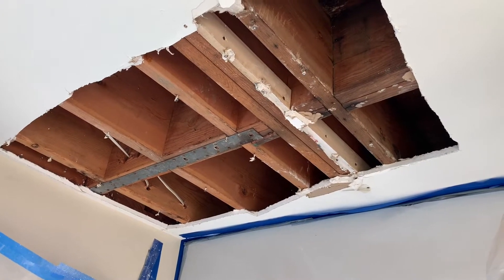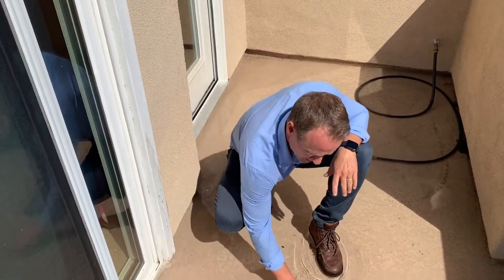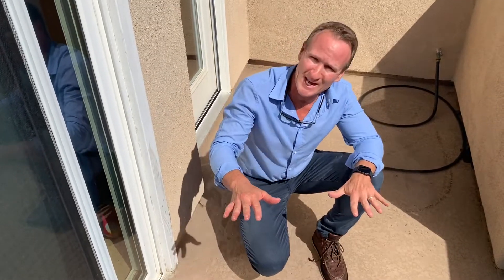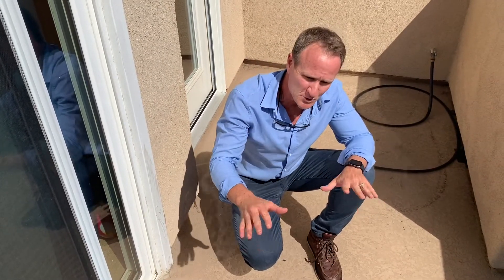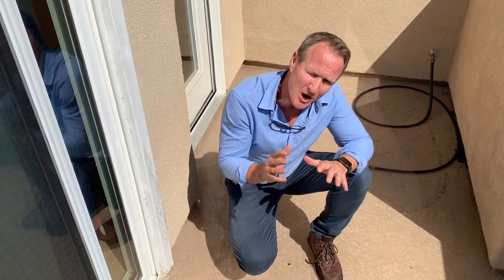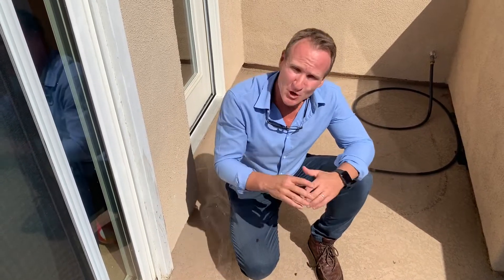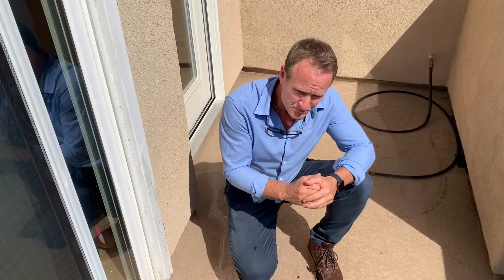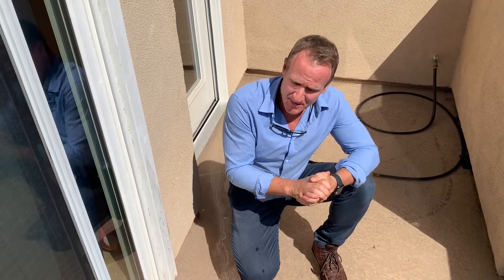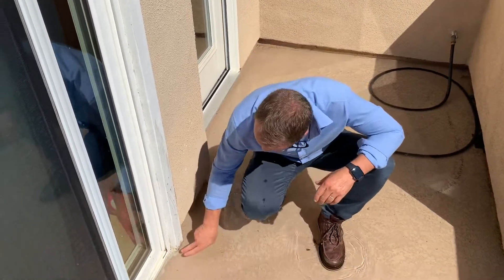Let's go upstairs above this area. As you can see, we've completely filled this deck up — we call this our hydrostatic water test. We're testing to make sure the decking material has not been compromised. We like to keep this hydrostatic test going for a good 30 to 40 minutes. We've got about an inch of water on top. We also use plumber's putty, as you can see.